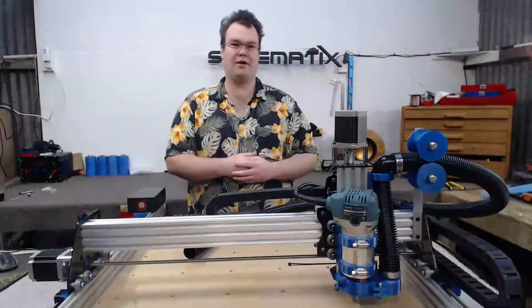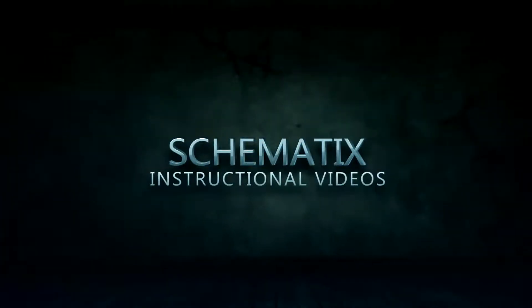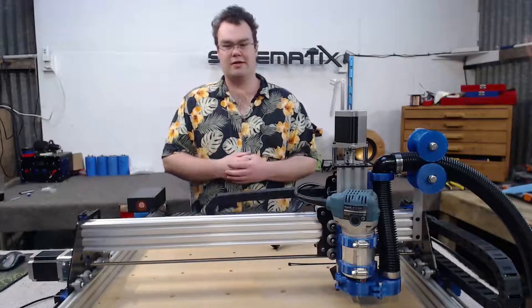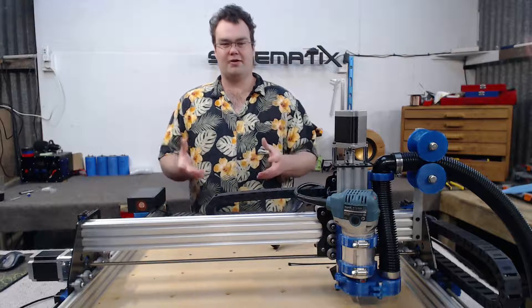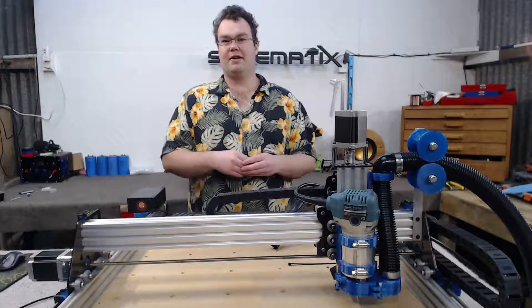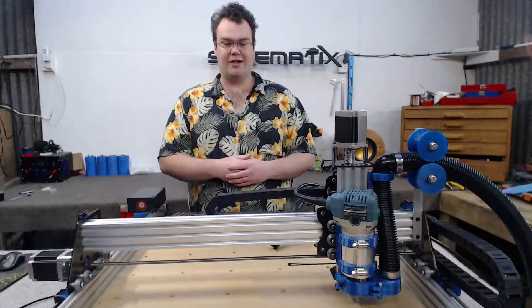In this video I'm going to show you how we can add a dust extraction system to the Ox Metal. The way this dust extraction system works is we have a vacuum shoe surrounding the router itself and this catches most of the fine particulate and the medium particulate. Some of the larger chips do actually fly away before the vacuum gets a chance to suck them up, but it is kept to a fairly low minimum and is a huge improvement over without the system.